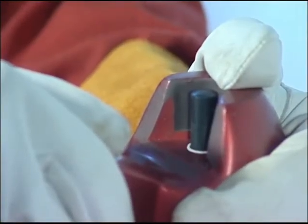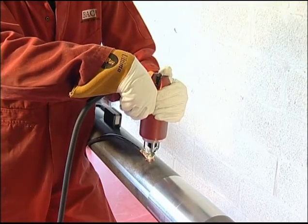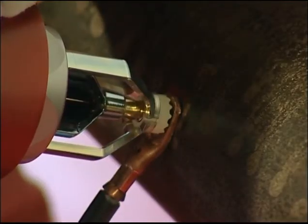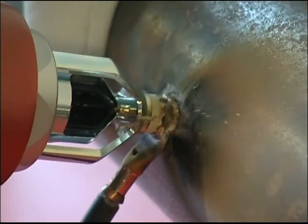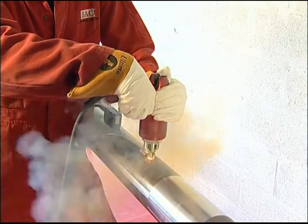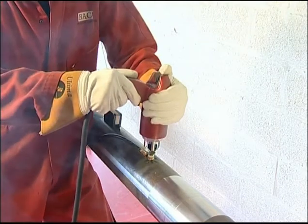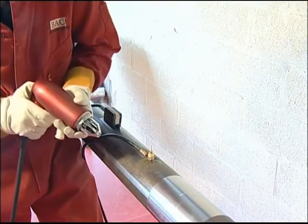Once set up, stand preferably resting against a secure object and squeeze the trigger. This should click and brazing should commence. It is always advisable not to look directly away from the braze operation, as you may inadvertently move your positioning. Once the brazing has stopped, approximately 2 seconds, hold for a further 2 seconds, then pull the gun straight back from the braze. Don't prise the gun from the pin shank.